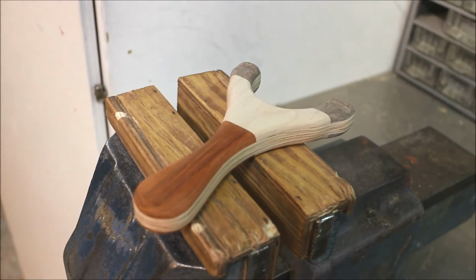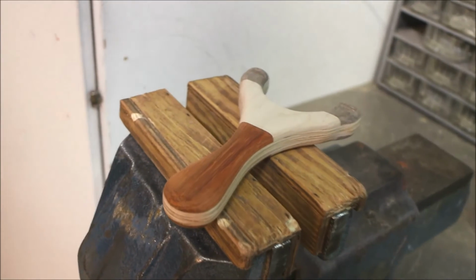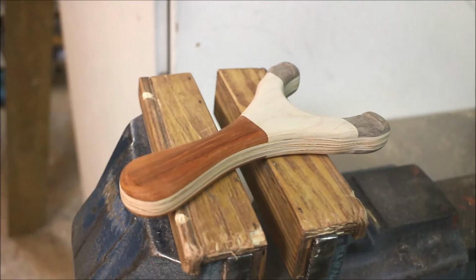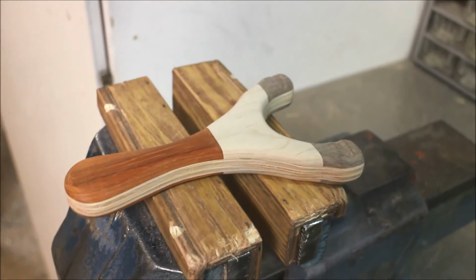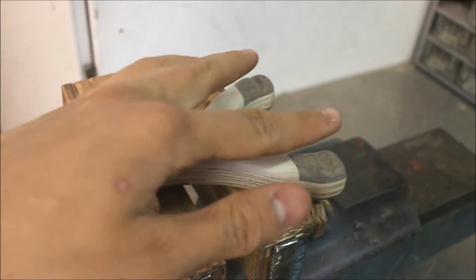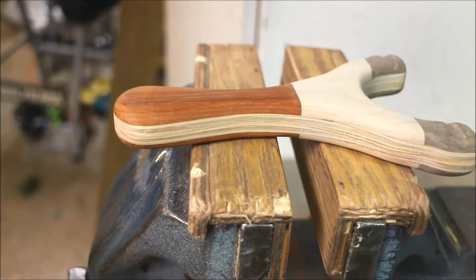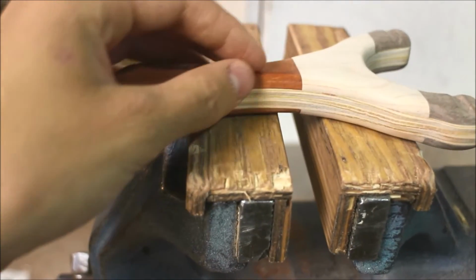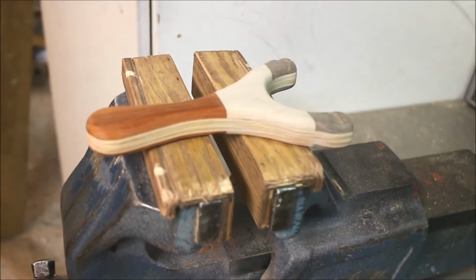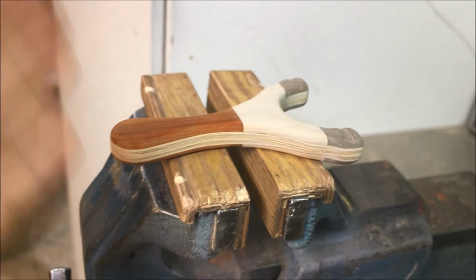You wouldn't believe how hard it's been to sand this thing. As soon as you add water, the wood sucks up all the nearby dirt, which you then have to sand off every single time. Also, we have two highly pigmented woods. The dust coming from the red sandalwood and the walnut both wants to darken the maple. For example, once I sand the red sandalwood, the dust will go into the pores of the plywood core. So save yourself some time and don't add water to a frame that is laminated.